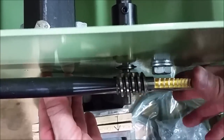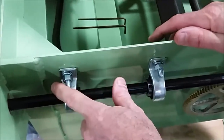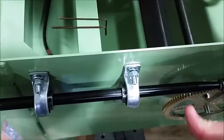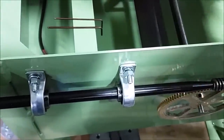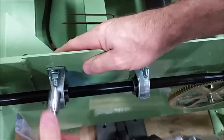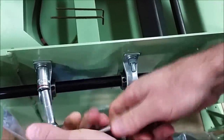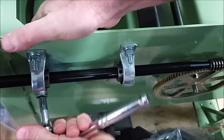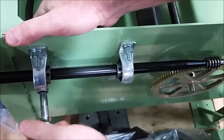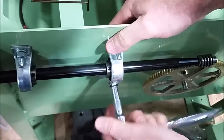What I do when I start is take these bolts over here and snug them up a little bit. When I snug them up it's going to pull the shaft back this way, which affects my center line. So I snug them just until I see my lock washers compress — it doesn't have to be real tight, I'm not going to tighten them enough to spin the bolt head on the inside. I just want to compress the lock washers and confirm the shaft is fully over.